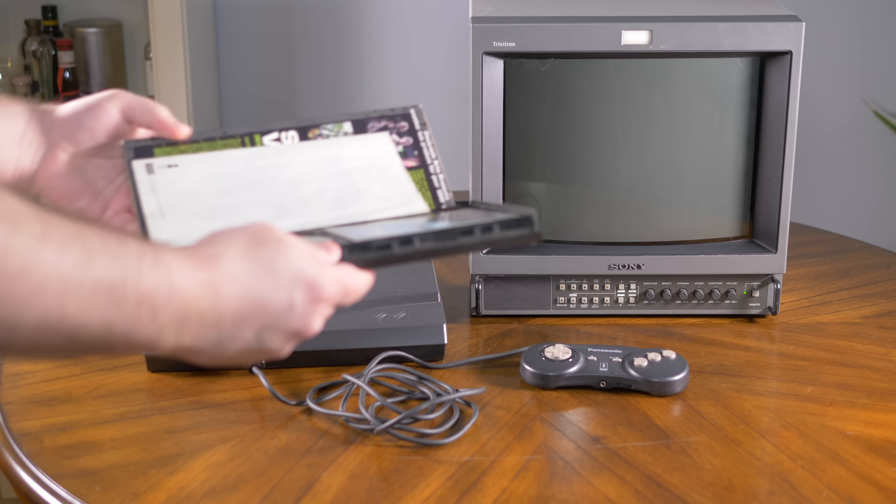Modders are able to install this switch in most 3DOs, but the hack never quite worked right. MyLifeInGaming did a great video about this linked in the description, but in short, sometimes the 240p mod either wouldn't let you boot in 240p, or the image would be shifting wrong and you'd have to play around with it to get it to look right. Dan's mod handles this switching perfectly, allowing you to either always leave it in one place or switch on the fly. A few games end up running too fast in 240p mode, which is a result of the game itself, not the mod — this makes Out of This World impossible to play and Wolfenstein 3D is annoyingly fast, though not too many games are affected.